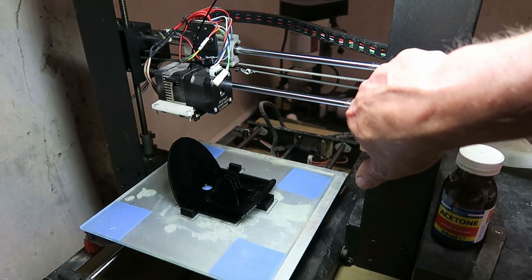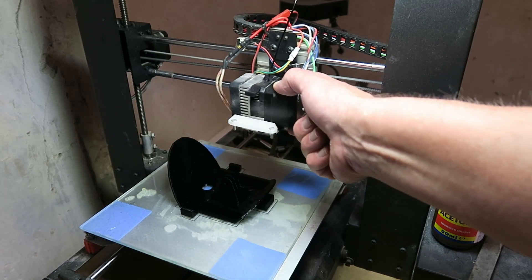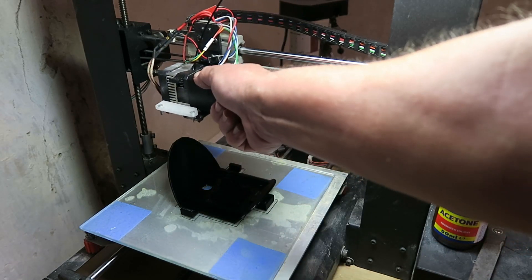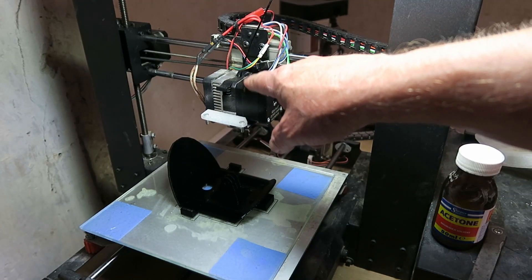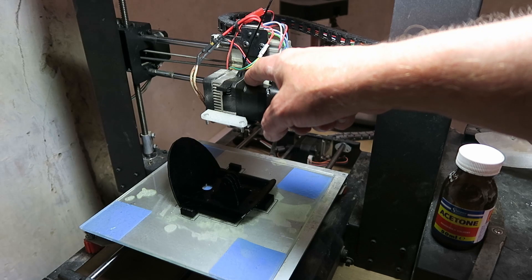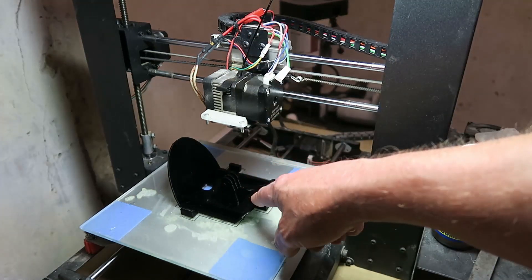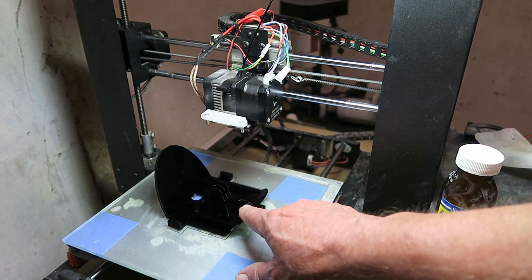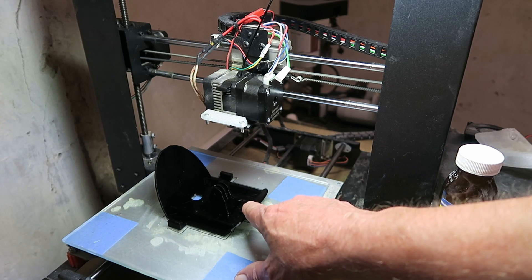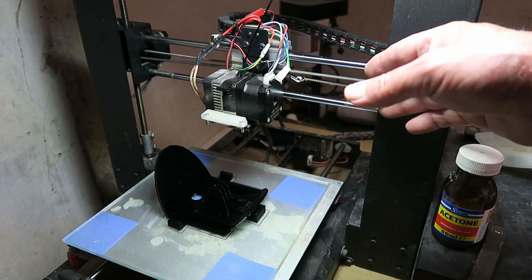Off to the side here, you can't see it, but behind here there is the Y-axis positioning in this way. And finally, yet another stepper motor which feeds the filament down into the hot end to extrude it. The fine control enables you to print out objects such as this new canopy for my Bixler glider. You'll see similar arrangements in a CNC machine or indeed a laser cutter.